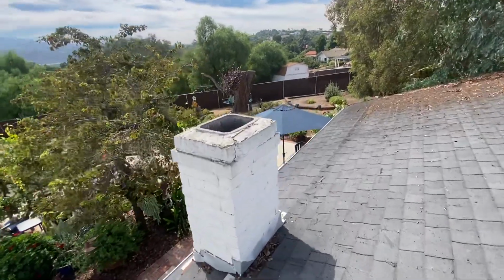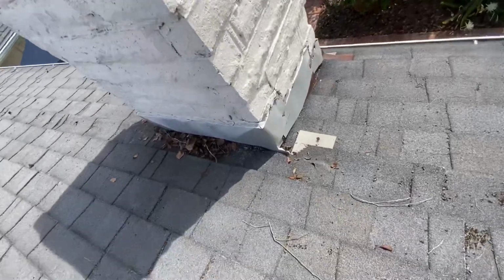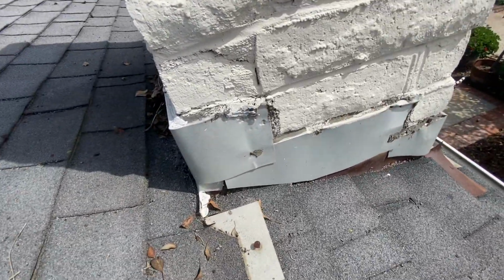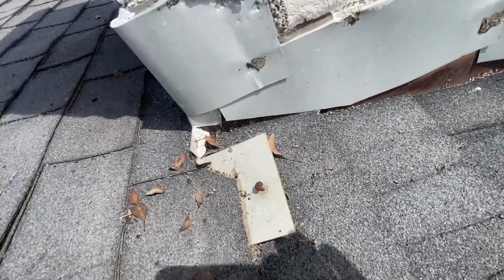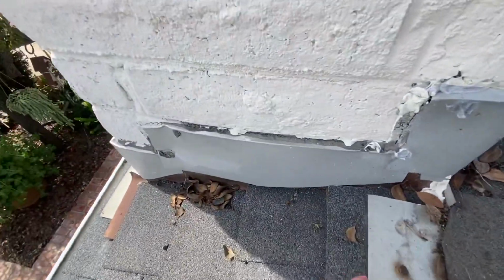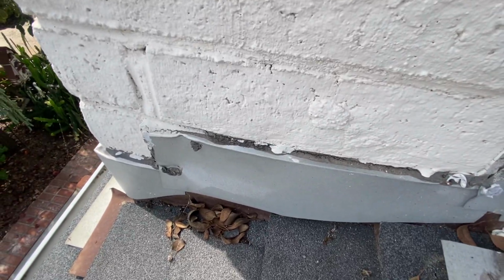And he does have some water damage near underneath the eaves on the starter board, kind of right near this chimney. And as you can see, the flashing job doesn't look proper. We've got some lifted flashing, some exposed nails on both sides actually. So all this flashing is just not doing anything. And this is a repair job that looks like it was homemade.